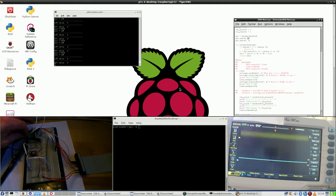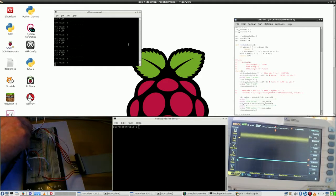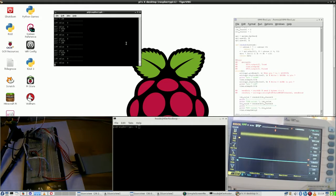Looks like quite noisy, by the way. It responds directly to me touching the NTC. So that is working. Then now I do see, by the way, I saw some values. Let me get that back if I can. Those are some values. But, oh, that's just the LDR. NTC value still absolutely 0.